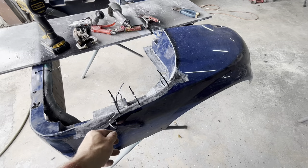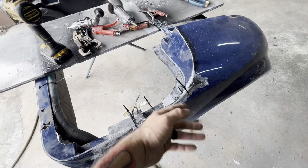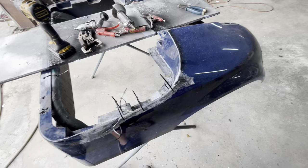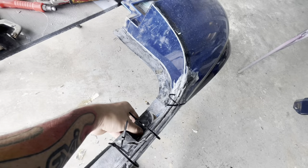We're probably just going to let this one dry all overnight. You can follow the directions on the tube, but we'll let it sit for the day. Then we'll come back tomorrow, take our grinder, cut all the zip ties off on the face — leave the back ones, they don't matter — grind all the excess off. If there are any areas we missed, we'll V-notch again, put more in, and then we'll be good to go.